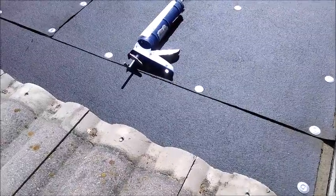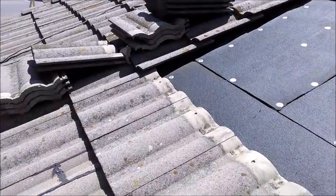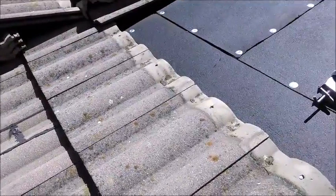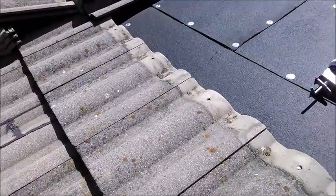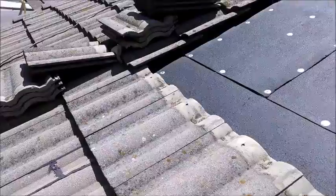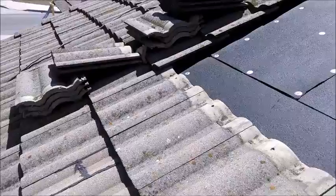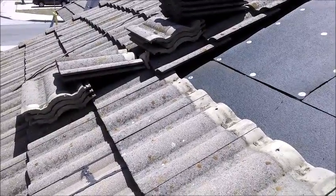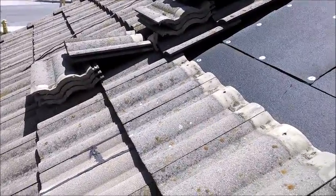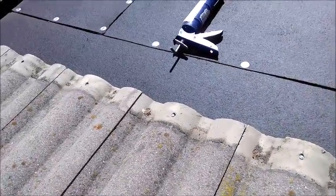The other thing is safety. Obviously these roofs have a pitch, and without nails or glue, these tile will slide and could feasibly slide off the end of the roof and hit a child, a grown-up, or even a pet. That's the last thing you want to happen. Even if you don't think you care when you're putting the tile back in, if somebody gets hurt because of your work, it will bother you for a very long time - if not the rest of your life. So nail all the tile or glue them to other tiles that you know are nailed properly.